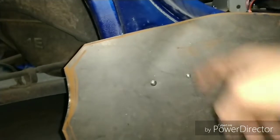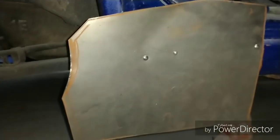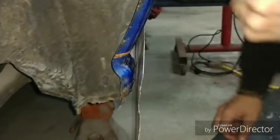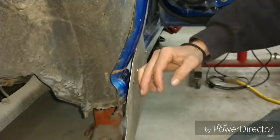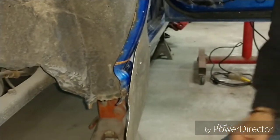So I'm going to go ahead and take a lot of that pressure off right now, and you can see the dimpling and whatnot. So that's generally the area when you've got pressure, and we're going to have to relieve that because steel just wants to retain its original shape. Alright, so I'm going to take off the pressure right now, and in order to do so, because we have that high spot, I'm going to bring in where the inside here has the most area that needs to be manipulated, and that's obviously this pocket here. So once I start pushing the steel in that direction, it'll take a lot of the strain and stress off of it that's being accumulated now because of these screws. So I'll do that now.